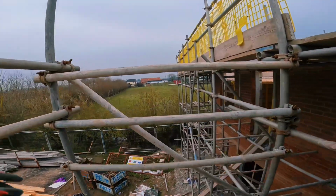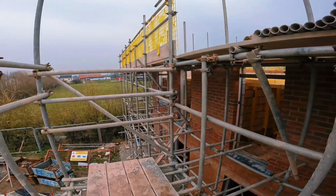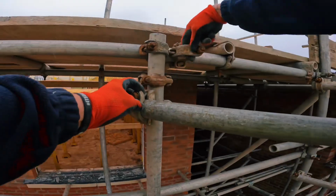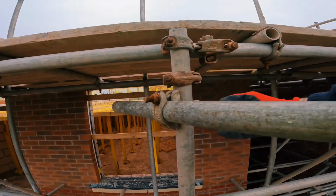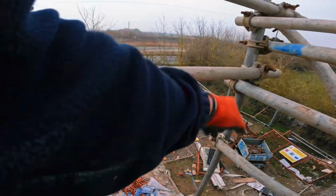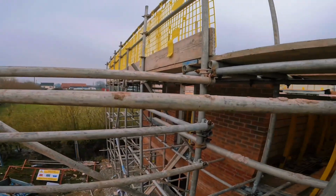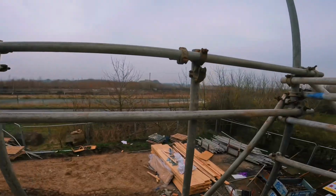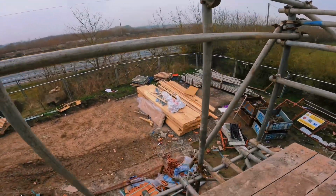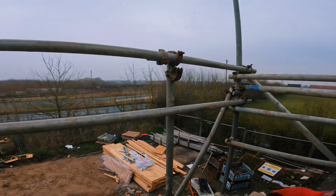Be ready for some transoms again. Let's have ya. See the set. Both plan braces installed, dub. Make sure you go the opposite side if you do build it like this, so you don't interfere with your other punching that's going in here. I need one sway brace straight up the side here, and then we'll start transoms. Catch in a sec. That's a sway brace installed now. Keeps the legs nice and level and tight. Should zigzag all the way down to the floor. Zip, zip, opposites all the way up.